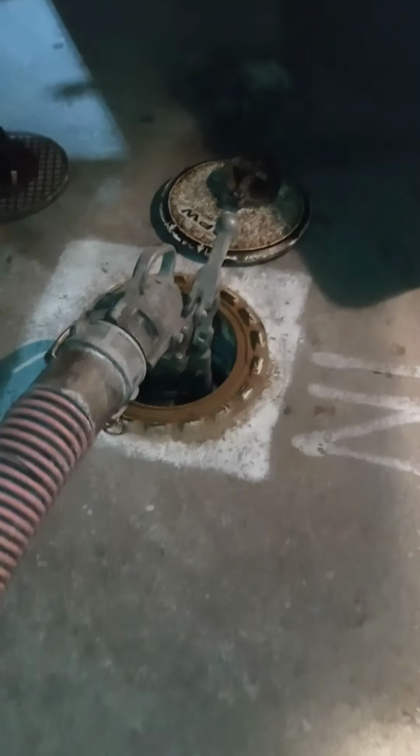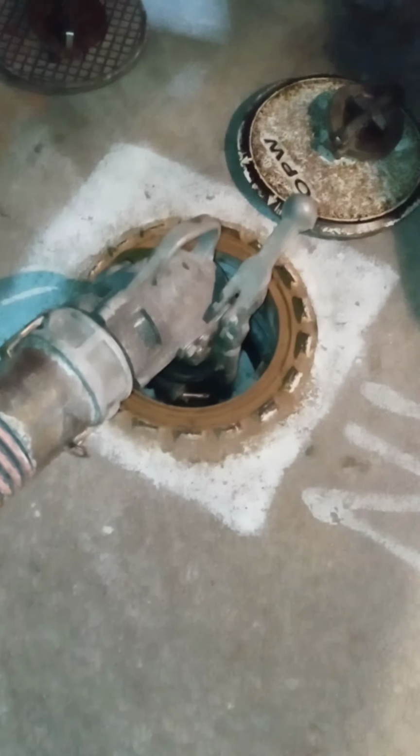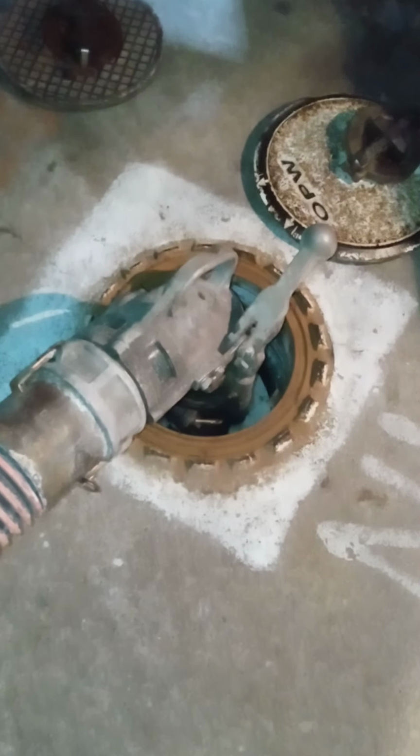Once you've found out where the drops are for the correct product that you're going to be delivering, you're going to want to take off the cap for the vapor and for the tank. And then one thing that I like to do is put these on there, because there's a spring-loaded valve that you got to push down, which releases all the pressure built up in the tanks.